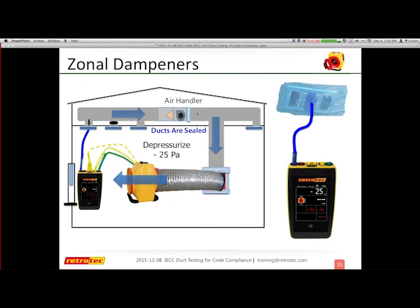So that damper must be closed. It normally is. You would want to make sure of that, because you could have a huge artificial leakage by having a 6-inch duct typically just going to the outside. It's not something I'm trying to close, or a requirement that gets closed, but I need to make sure that the damper is in a closed position. Hopefully that answered the question.